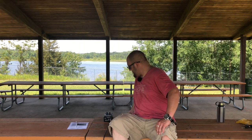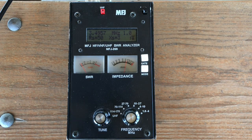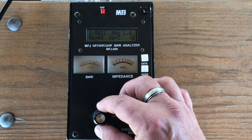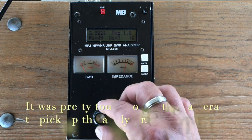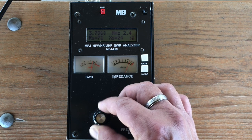Alright, so I've got the antenna set up and hooked up to the analyzer. I wrote down the band plan on my notebook here because I honestly don't remember all of them. So we're going to sweep it through the analyzer and see what it looks like. As most of you guys know, I am not a QRP guy, so this is going to be a new challenge for me. It says 80 through 10, so let's sweep 80 through 10. There's 80 — the very bottom of 80 — 50 ohms, 1.0. Perfect. So then we go all the way up, sweeping to 4 megahertz.